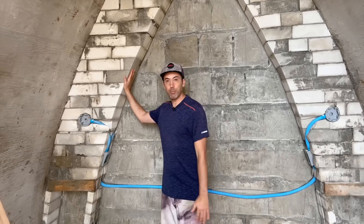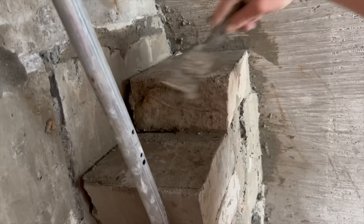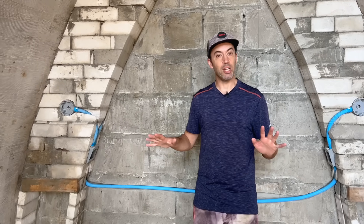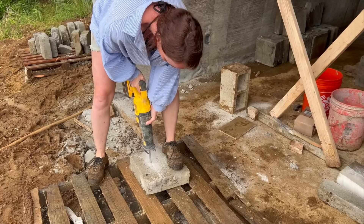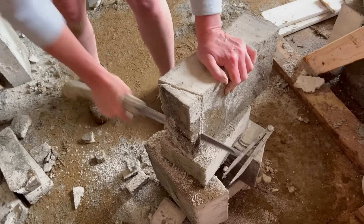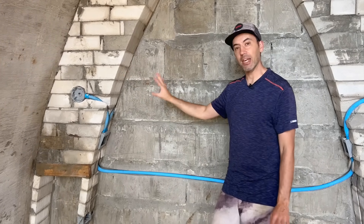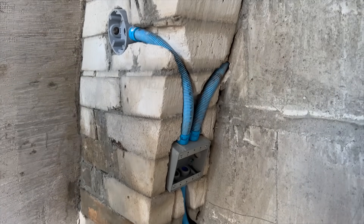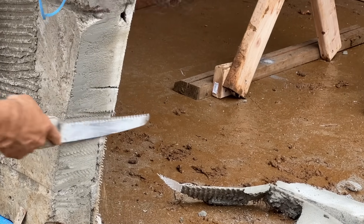This exposed aircrete wall is made with cement and foam, so it doesn't rot, doesn't rust, and isn't eaten by insects — making it suitable for all climates. Aircrete also has insulation value, so you don't have to add extra insulation. It's hard enough to hold up a whole structure but soft enough to easily cut and carve. When building a wall like this, aircrete is incredibly forgiving — you don't have to be precise because you can easily shape it, cut off anything that sticks out, and fill in gaps. That makes it very accessible for beginners with minimal tools and experience.